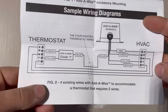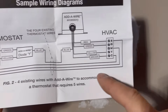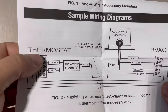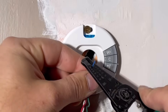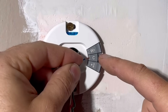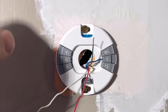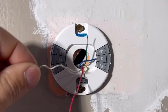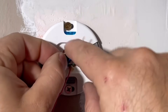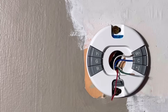This is the schematic we're going to follow since we have four existing wires. R, W, and C will go straight to the HVAC equipment. We're going to make C blue because that's how I prefer it. So we're going to make our connections for R, W, and C. We're just going to strip that, press down the C button and slide it all the way in — you know it's locked when it stays down like that. This green wire will connect to our little device we're about to put in. White will go straight to W just like it was, and R will go to R.